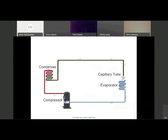With capillary tubes - another metering device between high side and low side, with different lengths or different diameters, acting like a fixed orifice in an air conditioning system. The longer the cap tube, the less flow; the shorter, the more. They're usually used in stable-ambient applications like a domestic refrigerator where you don't have big changes in load. The cap tube catches up in its own time. You don't need a receiver with a cap tube because it doesn't change flow rate.